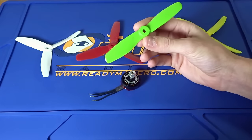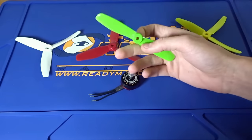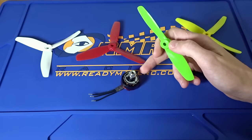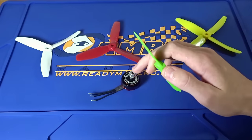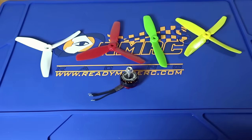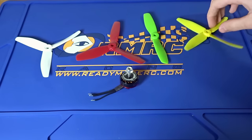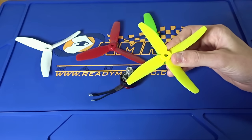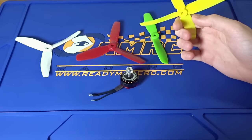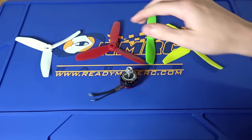On the DAL two-blade, we didn't get nearly as much thrust — only 1,136 grams — but 26 amps with higher efficiency. If you were going for all-out speed, maybe this prop and the 2,600 kV version of this motor would be the way to go. For the DAL Q5040 quad-blade, just peaking over 1,300 but settling at about 1,280 grams, once again at about 32 amps. Good thrust improvements for not too many more amps.